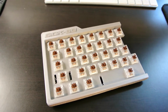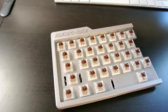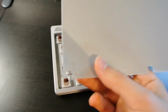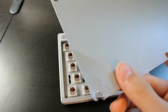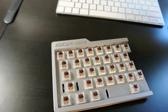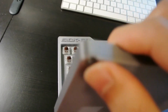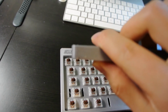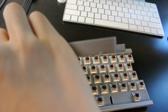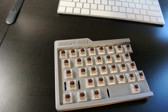Okay, so it's actually been about 2 weeks since the first part of this video, and what happened is the first time I tried to print, this happened. So basically the bottom left corner got really messed up and I had to stop the print. But I tried it again recently this weekend and it turned out pretty well. So the corner still warped slightly, like this part lifted up a little bit, so did this part, and it's probably because warping is pretty inevitable with corners, it seems like.